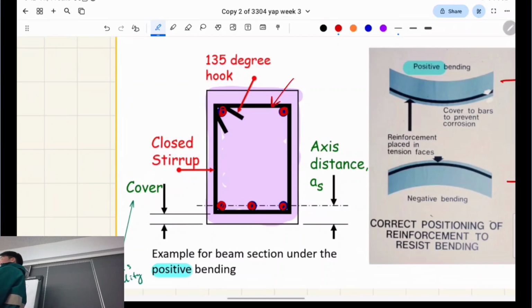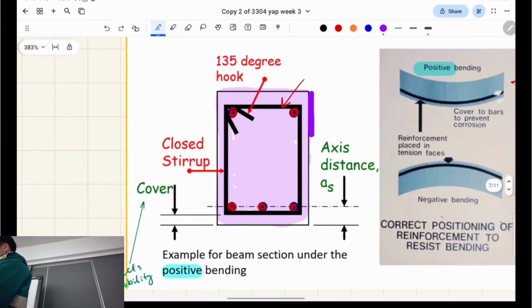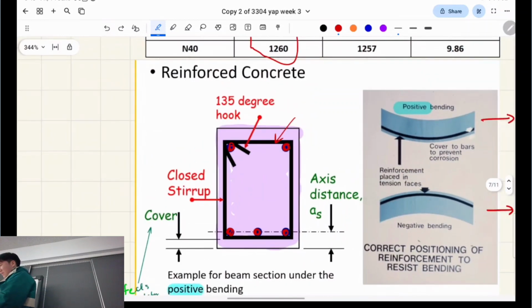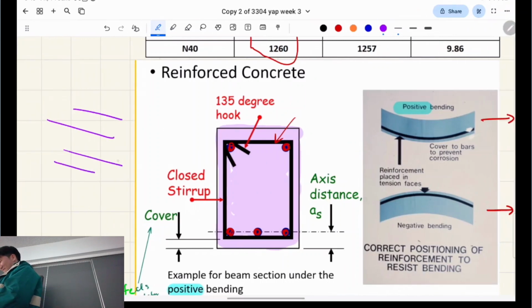Okay, what's this black rectangle? Is it the thing that tells you where the steel is supposed to go? The formwork? Not quite. If you were to make timber formwork, it would go outside, and that's where you would pour the concrete, but we don't do that in the design room. It's so that the steel is not exposed. Cover. The cover is due to the concrete, right? Okay, basically, I'll spill the beans. Yes, very good.